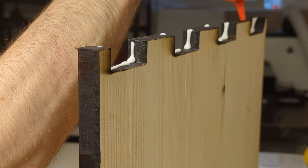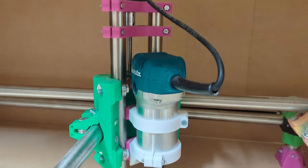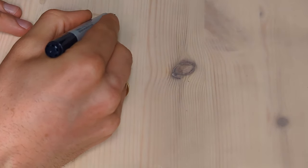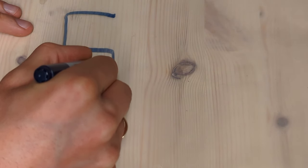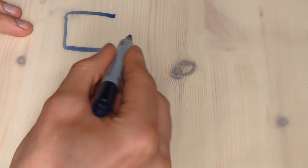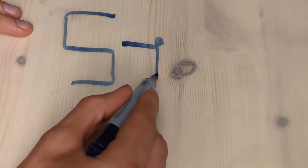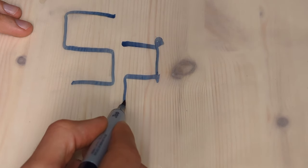This is also a good time to explain why building furniture with a large format laser is so interesting. You could use a CNC router to make furniture obviously, but there is one slight issue — if we use a router to cut out traditional joints, the corners will almost always be slightly rounded. There are things you can do to work around this: you can design special wood joints that can be cut by a router, or you can do extra movements on the outer edges to make them sharp, as you can see right here.